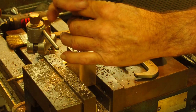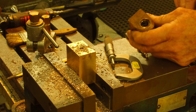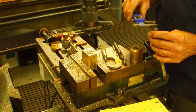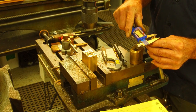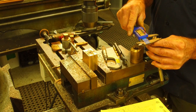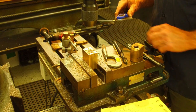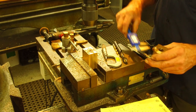All right, now we're gonna find out what size the tap size is for the nut. Took a break from the project here for a quickie there, and I'm checking the minor, or the minimum diameter of this ACME tap here on the end. Kinda always wanna make sure the tap's gonna be able to start in the hole at least, right? So 546. All right, now we reach in here, we got like 545.